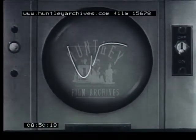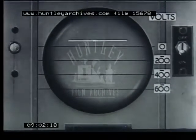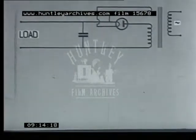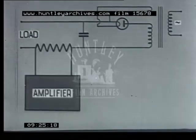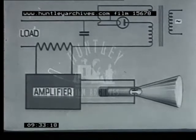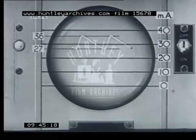We have seen that a cathode ray tube can give a very clear and useful picture of variations of voltage at almost any frequency. By applying a succession of known steady voltages and marking the tube face accordingly, the peak value of unknown voltage waveforms can be estimated. It is equally simple to study the current in a circuit, since if we insert a suitable resistance in series, the voltage across it will be proportional to the current. This voltage, amplified if necessary, may then be applied to the Y-plates of the tube in the usual way. By passing a succession of known steady currents through the resistance, the tube can be calibrated and the peak value of an unknown waveform can be estimated.